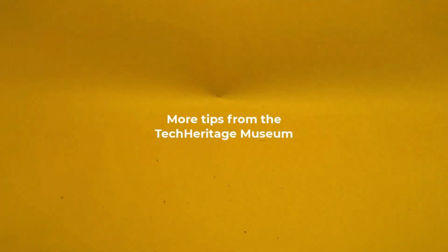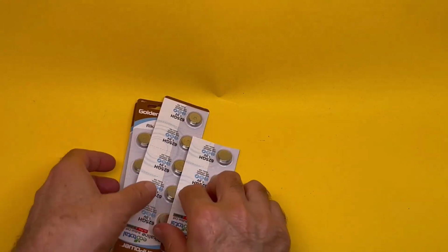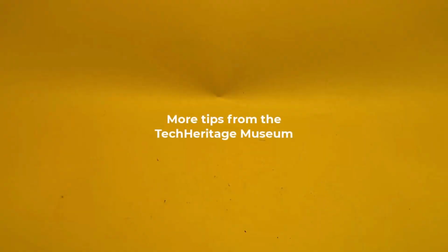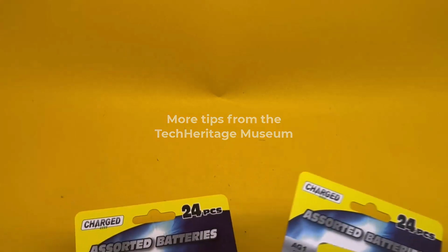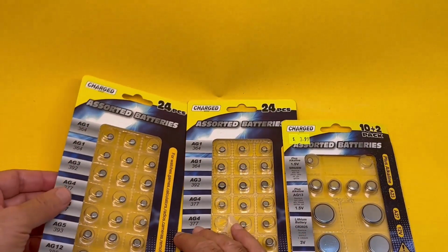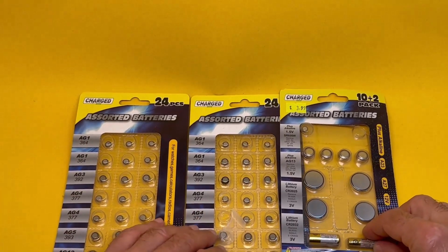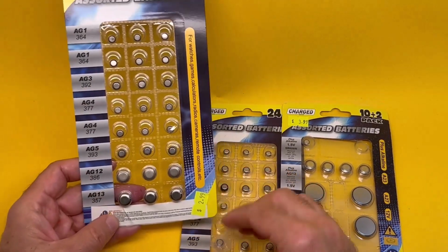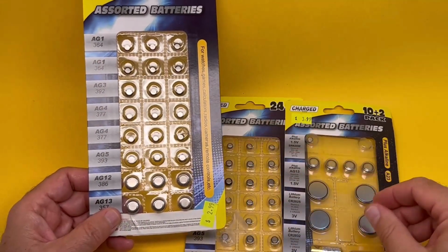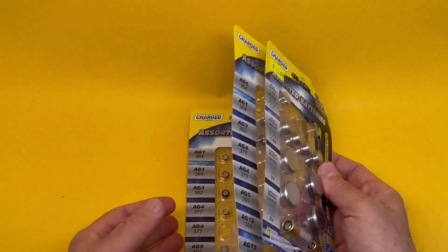When we find the right battery, for example, the replacement for PX625, we buy them by the dozen so that we're guaranteed to have some in case they stop the production of these eventually. If you go to those cheap $2 stores, every city, every country has them, even Daiso and so on, they sell you these things for nothing. Assorted batteries. I guess they're made in China. There's every size used for batteries, cameras and so on. Very generic. And you're bound to have the right type somewhere there. At least the right voltage, the right thickness and so on. You can make them work inside your camera using an adapter or a ring around it or a sticky tape or even a bit of aluminium foil. So you can get several of these. You'll never be stuck.